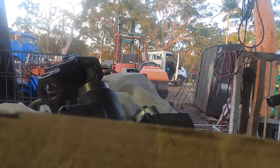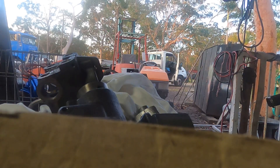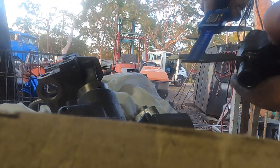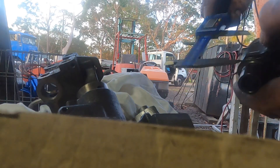So two inches 46 — two inches 46 is the target. So we're going to take off roughly three hundred and thirty thou — three hundred and twenty something thou — chop that off. Yeah, 46 there, so they're going to get a dead height of two inches 46, so lop all that material off there.